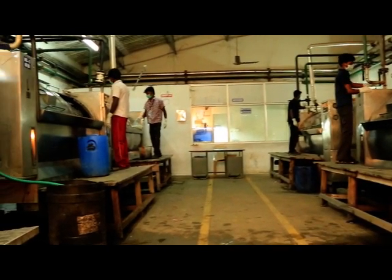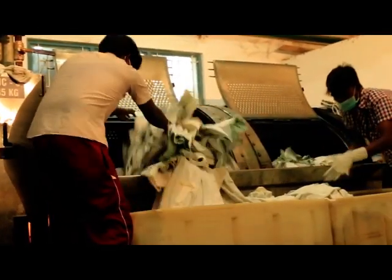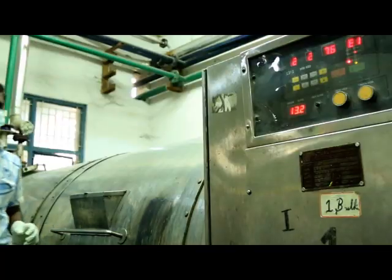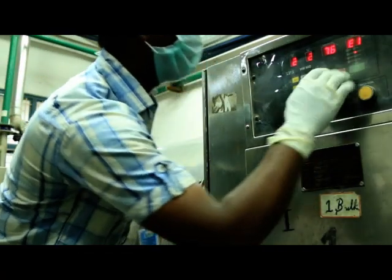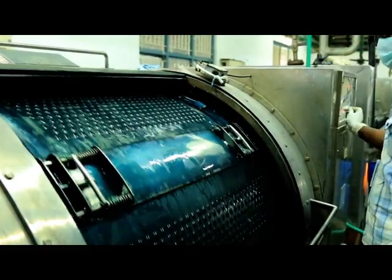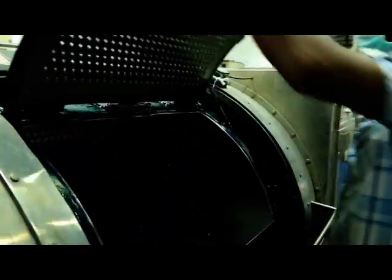Pigment dyeing is actually not dyeing in the real sense. It is the immersion painting of a garment with a very thin, soft fabric paint, so-called pigments. Pigments are insoluble to water, which means they need a binder in order to be able to stick to the fabric. Pigments are more likely to wear off, and after several times of washing, the color of the garment will fade.